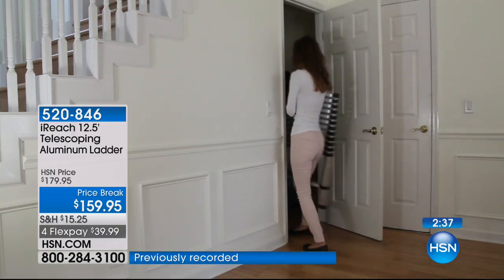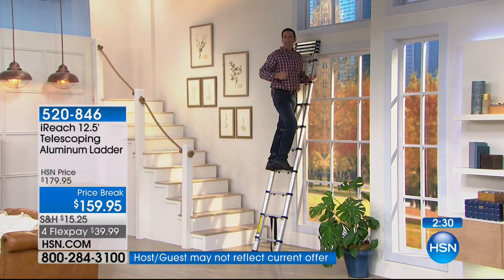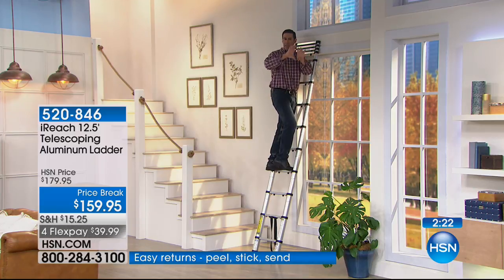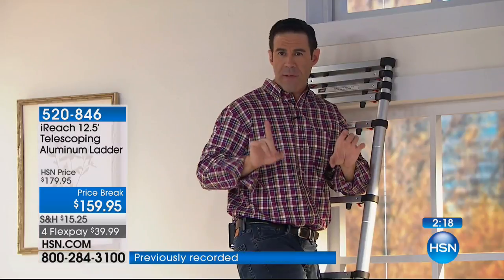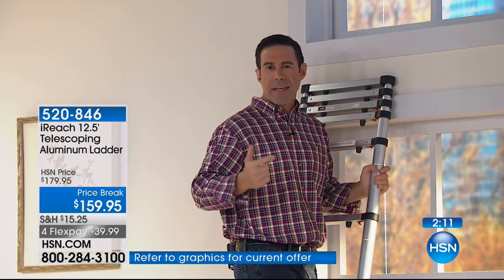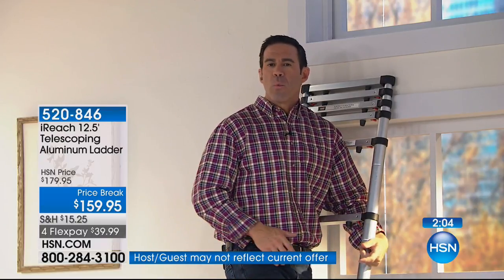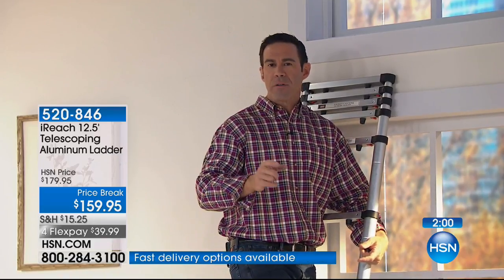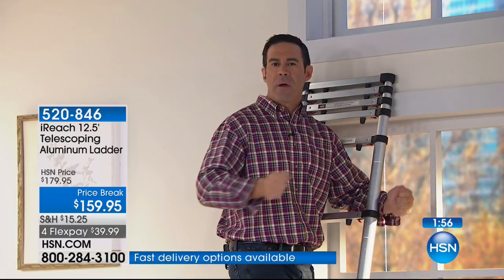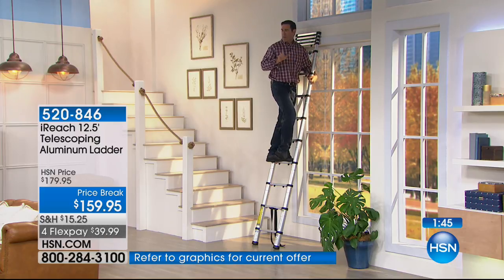Think of all those tasks that are over five feet. When extending for just the amount of ladder you need, do it from the bottom up so the bulk of the steps you're not climbing stay at the top, and you don't have to step over them at the bottom. Now I've got a six-foot ladder, a seven-foot ladder. The safety indicators show when it's fully extended as much as you need it. Safety, ease, and storage — a very good solution. And with storm season and the holidays coming up, you'll be able to hang lights around the gutters with 20 pounds instead of 30 or 40, with more ladder than you actually need.